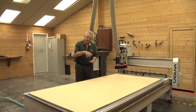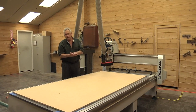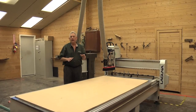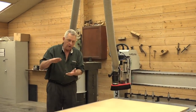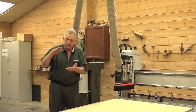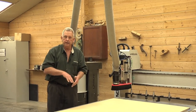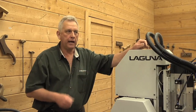We've got our spoil board material on the table. This is three-quarter inch MDF from a local big-box lumber store — nothing special about it; in fact, the cheaper the better. Our whole goal is a material we can pull vacuum through — that's called flow-through. When MDF is first made, it's pressed so the surfaces are very dense and block the vacuum. So our first challenge is to remove that, and that process is called fly cutting. We'll use an inch-and-a-half diameter straight router bit to create a huge pocket, removing about a sixteenth of an inch of material, which gets us through that compressed area and at the same time makes the surface line up with the spindle automatically. Once that's done, we flip it and do the other side. I'm going to power up the machine, turn on the dust collector, load the fly cutting program, and let's fly cut this table.